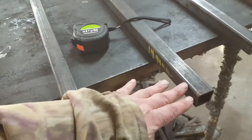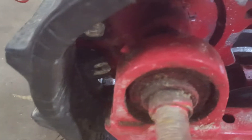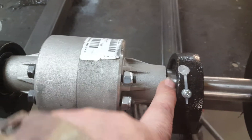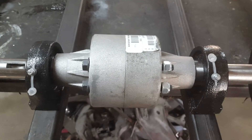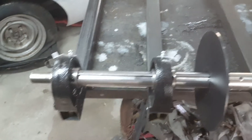So to recap: about 34 and a half inches wide, 34-inch track runners, 42-inch main center beams. One more thing to think about — these pillow block bearings have grease zerks. I pointed mine backwards because with one facing forward it's very hard to get a grease gun in there. If you do point them forward, note that the collar sits flush differently, so things won't be perfectly aligned. I don't love the zerk sitting backwards either, but you need to be able to grease these without pulling the tracks off every time.